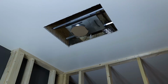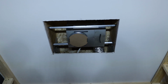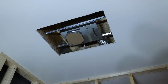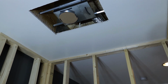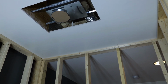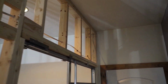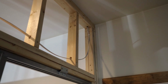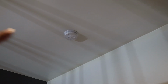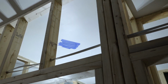So that's right here. So I cut a hole right in the ceiling between these 2 floor joists where I wanted, because I knew this had to mount the whole way across, so I cut a decent sized hole so I had enough room. As you saw, I fed the duct through using 2 broomsticks that were taped together, and that's because there's a lot of that insulation up there and it's kind of tightly packed, so I needed something pretty strong to be able to push through that insulation. And to get the wiring to that fan, I brought it across here, and then I actually went up right there because that is right beside my subfloor upstairs, so I could get to it. And then I basically came back down through to get right to the fan. And by doing that, I could avoid cutting up a lot more drywall in this room.